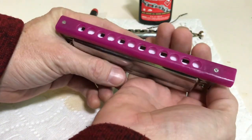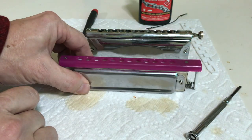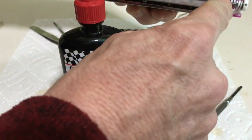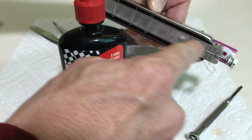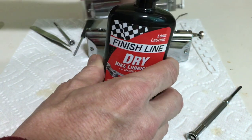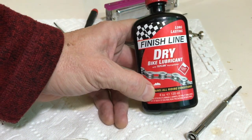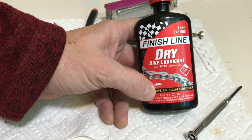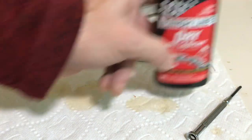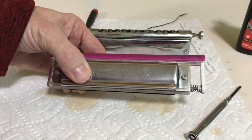So we don't really have to adjust. It's back together. Periodically you need to put some lubricant on this little bar right here — keep an eye on it and every few months you can put some of this dry lubricant on it. It's like a wax, and it makes it slide a little, smooths out the slide action. And also it keeps that little piston, which is made from a drill blank, from rusting.